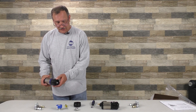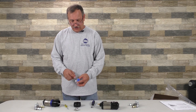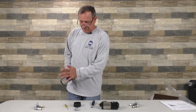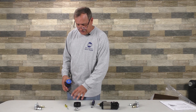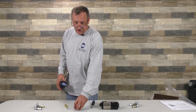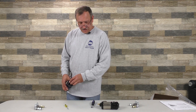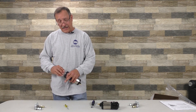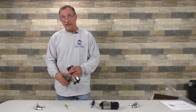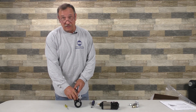Tighten it down, and the only difference is instead of putting in the side seals separately, they're already here and here on the slide-on piece. Just slide it on, pop it down, it locks in, cover goes over it, and the air cap is interchangeable. So instead of 35 to 40 minutes overhauling that gun, you can overhaul it in less than five minutes — or even less than a minute if you know what you're doing. The main thing is when you do that, make sure your valves are closed.